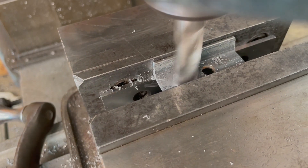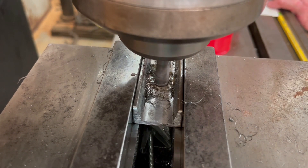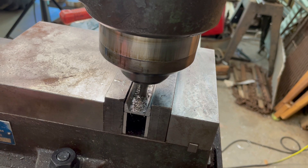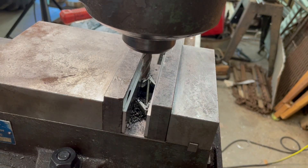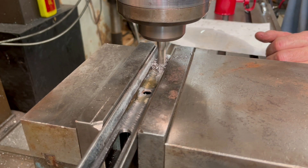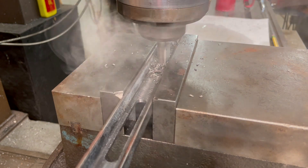This will allow for proper clearance and a flat surface for the knurled clamping knobs to engage. Next, I cut a three-eighths inch slot into each piece. This slot allows the clamp to be positioned at various angles and distances from the part, depending on the location of the part relative to the threaded clamping holes in the work table. Having clamps of different lengths and configurations gives more options when clamping parts of various shapes and sizes.